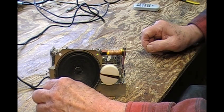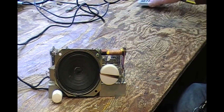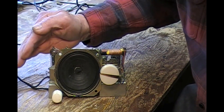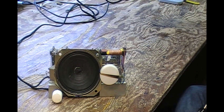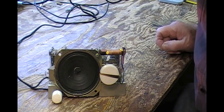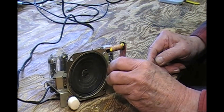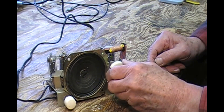The dim bulb is showing nothing — of course, I have to turn it on. We've got it at 60, 62 volts, and nothing nasty seems to be happening. Do we have any life in the tubes? Let's take a chance and crank the voltage up to 90 volts. I think I can see some glowing — yes, definitely. The rectifier is showing. Oh, we have life! The volume control's in bad shape.